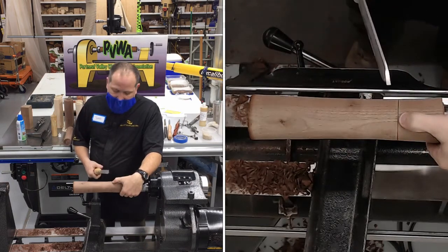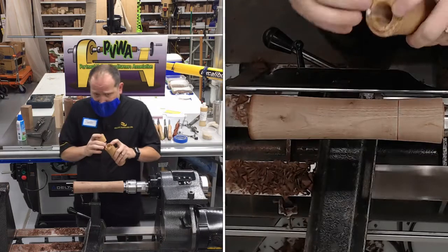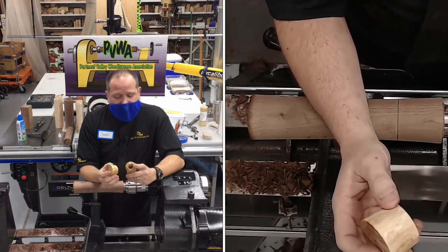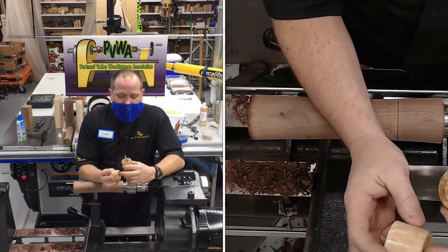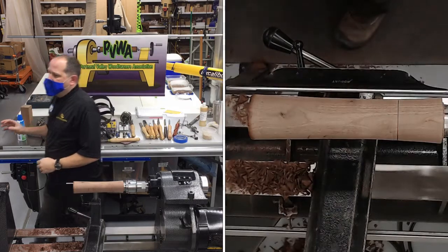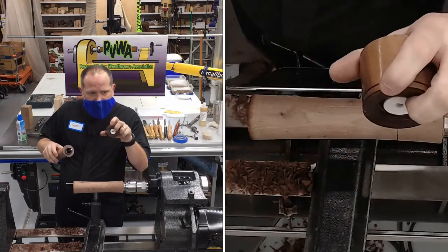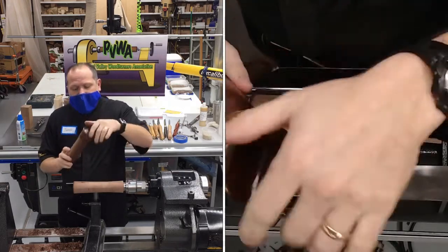Now on that, I'm going to make the tenon. It can vary on the size. Obviously, this one's much smaller because the wood's much smaller. But on that one that Blake has, and generally most of the pepper mills that I'm making now, I make the tenon just slightly larger than about 1 3/8. Then I'll take a 1 3/8 Forstner bit and drill that, and then I can just open it up to accept that. Yeah, so this one's a little bit bigger. Shows you there. This one I just sanded out to make it big enough so that the white top piece doesn't interfere with the turning mechanism. This one's pretty tight to push on there, but it turns pretty good.